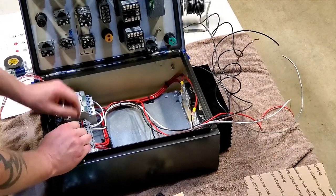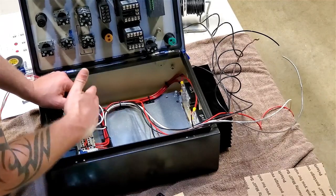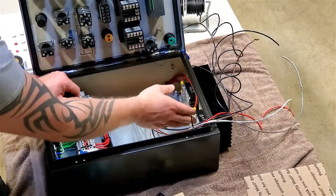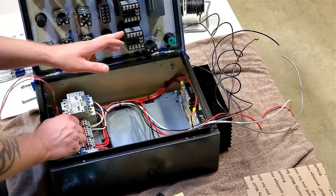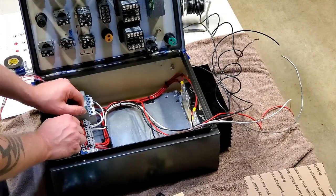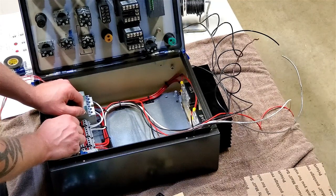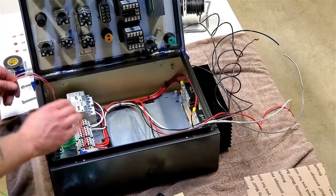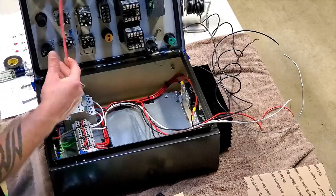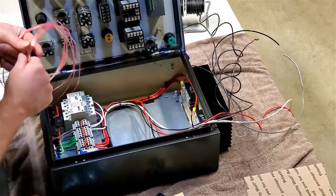Okay, I got the SSRs wired up. You see here, I have pretty good cable flow, comes in, hits these. I still have to run the DC from the PIDs over into this. It's going to be a different cord and wire gauge and everything, as far as getting feeds from this, minus my temp probes. This is all the wiring that goes to the door.